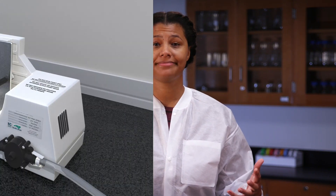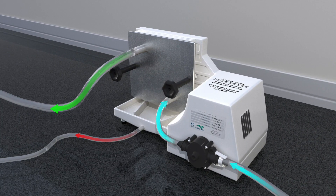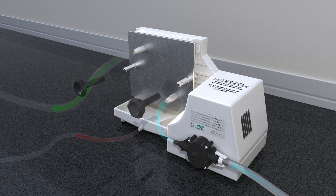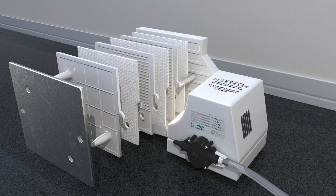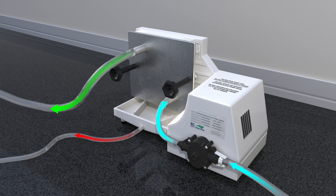Here's how the system works. The gear pump pulls up the fluid and pushes it into a set of plates. The plates hold filter pads. The liquid passes through but the solids stick to the filters.